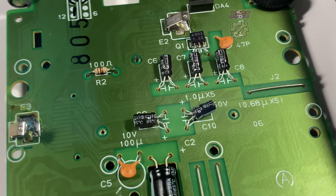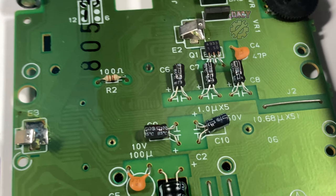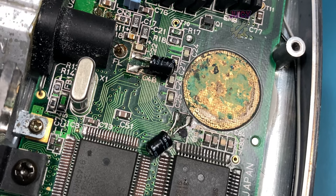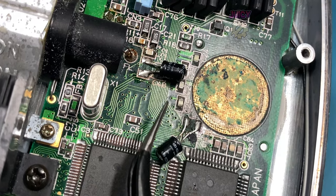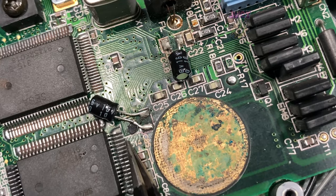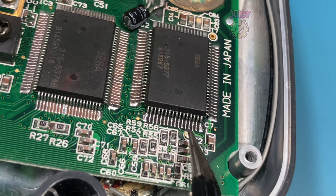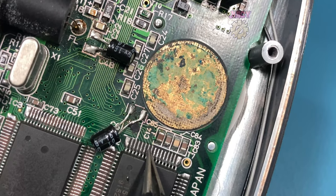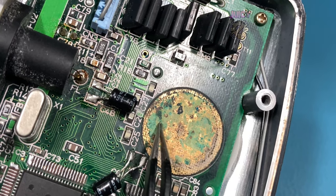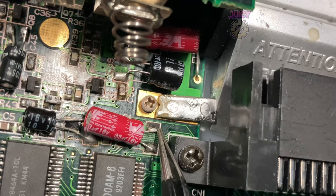With my background, I would love to talk about the elephant in the room - and that is the on-board capacitors, mainly the aluminium electrolytic ones. The reason I want to talk about this is because, especially given the age of some of these consoles, they can leak over time. Here I have a Game Gear where the capacitors have actually leaked - I've now replaced these capacitors and they won't leak for another 15 to 25 years. But as you can see there is a lot of discoloration and damage done to the pads and the joints of the rest of the board. They should look sparkling and shiny, but as you can see they look dull - and this was me catching it in time before significant damage was done. This is something you are displaying and it needs to look good, and it doesn't look good when the board itself has got corrosion all over it.